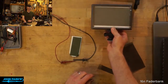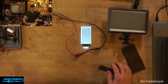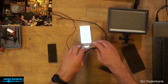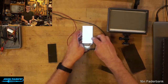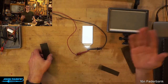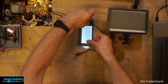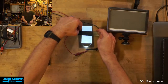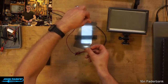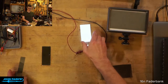The other thing I wanted to show is another way I've been looking at this is if I take one of our little 3-volt backlight LEDs. So this is going off. This is a little backlight LED. These are often used behind an LCD panel or maybe a gauge or something like that. Again, if you take a polarizer, you can really block the heck out of that light in some places. So there's a lot of neat effects you can do to break that up into sections. Of course, you can also PWM or on-off these things behind sections.